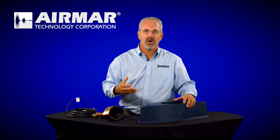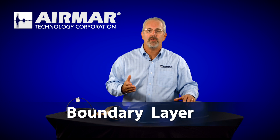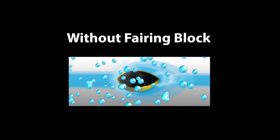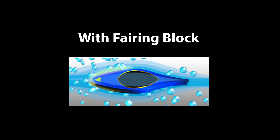In order to understand why, let's talk about boundary layer. The boundary layer is the layer of aerated water that travels down the hull as that hull moves through the water. Have a look at these pictures — this is a large sport fishing boat that's underway, and as you can see there is an amazing amount of turbulence running down that boat. The bubbles are going to be a thick layer between the clean water and the hull. What a fairing block does is get the face of that transducer past those bubbles and into the clean, un-aerated water to give it the best performing surface it can have.